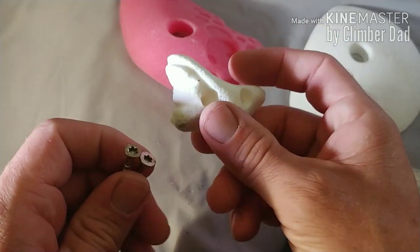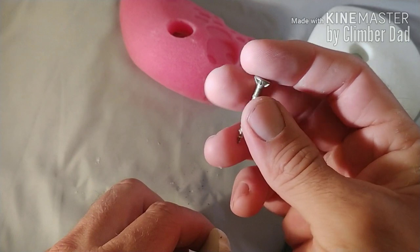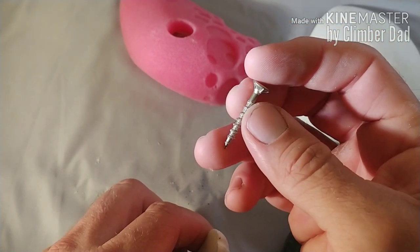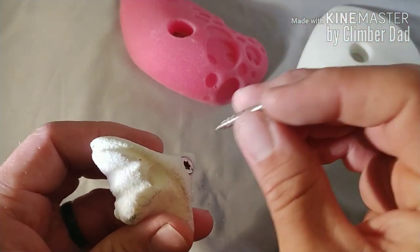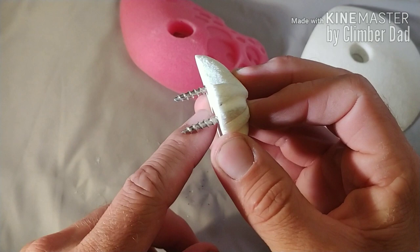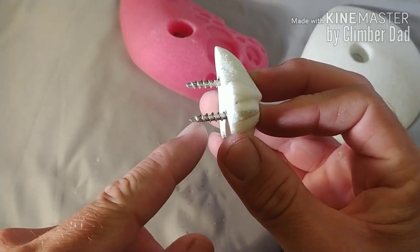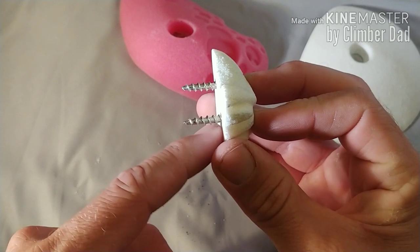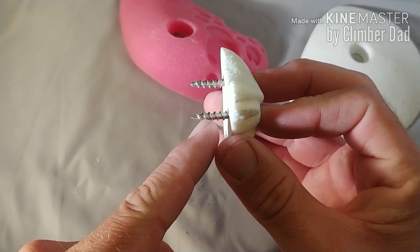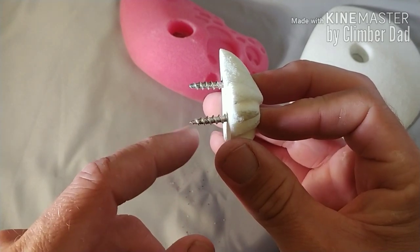Now, screw-on holds, you want to get something that has a little bit of thickness to it. I get these construction screws. I'll have a link down in the description where you can get these. And you need to have at a minimum of 3/4 of an inch of screw coming out from behind the hold. And I like to go a little bit further on this. I like to go out about an inch is nice on these holds.